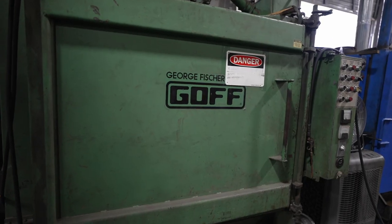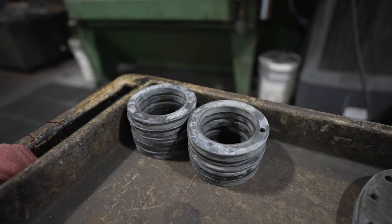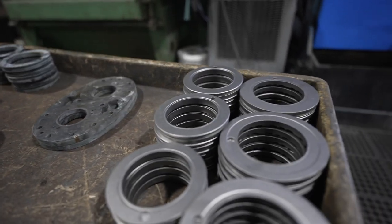That's when they're actually ready to start putting the compressor back together. It's going to land into the sandblaster and even a cleaning vat with some solution. This machine behind me is the sandblaster — they've got little tiny pellets cycling through the compressor body, trying to get any trash, any particulates, anything that's in there out of it. And from there it lands in a soaked vat where they submerge it and soak it.